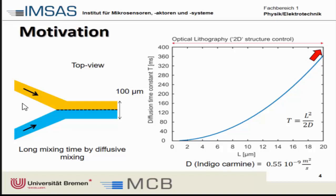In this well configuration we have full two-dimensional control by optical lithography. The question was whether we can use this as a platform and put some kind of structure directly into the microchannel, so we can increase the vicinity of each of these liquids with each other — for example down to the region of two micrometers — so the diffusion time constant reduces and the mixing vastly enhances.